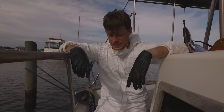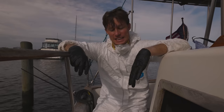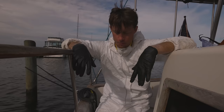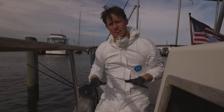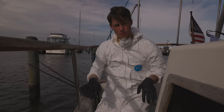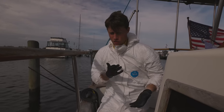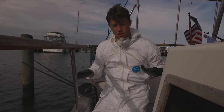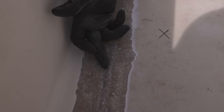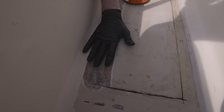Welcome back — it is the following morning. It's a little windy today and we have some foul weather coming tomorrow, so we're going to try to finish this one section today. It's warm enough so it should work out. Today we're basically going to be grinding away the edges where the layer fiberglass meets the existing deck so we can join them with new pieces of fiberglass. I already started and did half of one side — you can see where the line is. I need to grind this down a little more, then we're laying fiberglass here and making it all level in a later step.